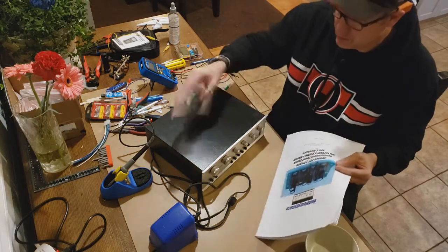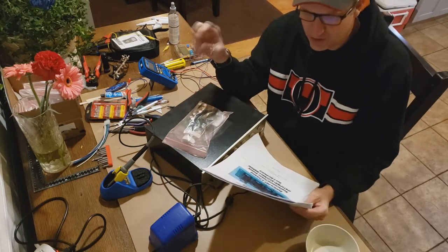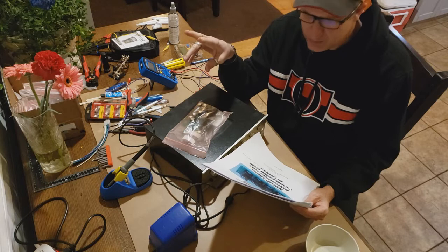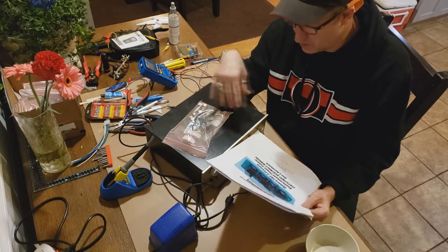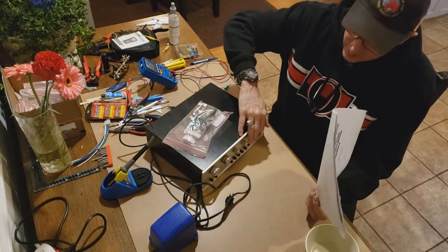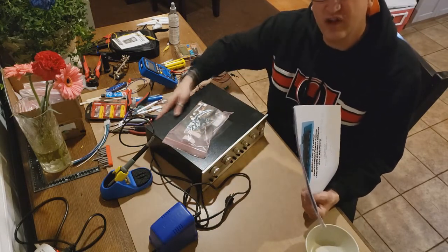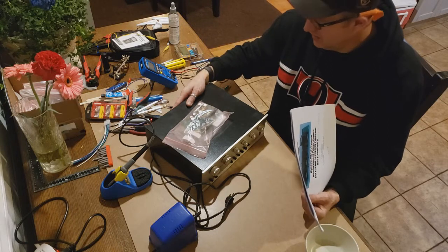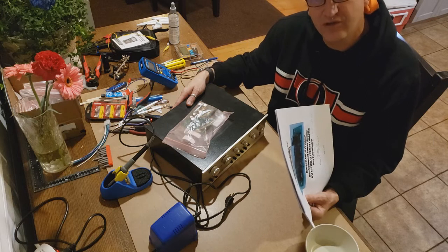And that'll upgrade the power supply. And then following that, I've got two phono boards and two line input boards that I'll be installing. And then we're going to have a good close look at all of the switching, and we'll be doing an upgrade to the RCA jacks on the back of it, and hopefully bringing this up to better than new standard.